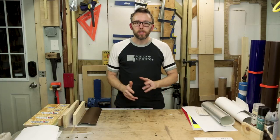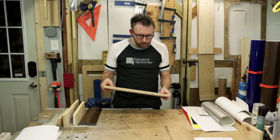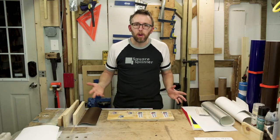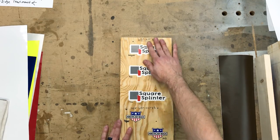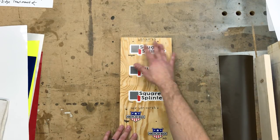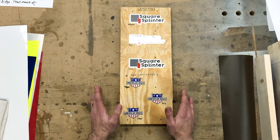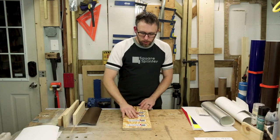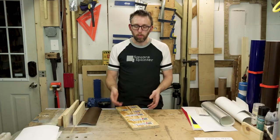After briefly telling you some of the best places to get the vinyl, let me show you some experiments I did so you can see how different things affect the vinyl as far as some different finishes that might be put on wood and whether it would affect your decals or not. The decals I have here — the top three, the ones that are my logo — are car wrap equivalent vinyl that has been laminated. The bottom three are the same vinyl but with no laminate on top. I wanted to see what this stuff would do when you sprayed it with different solvents or wood finishes.